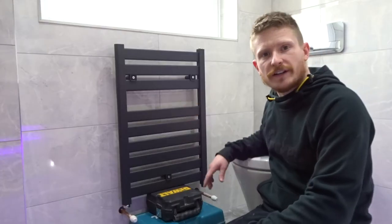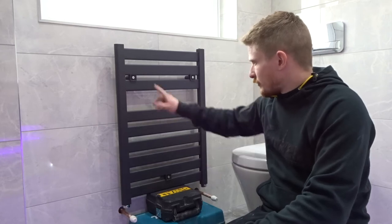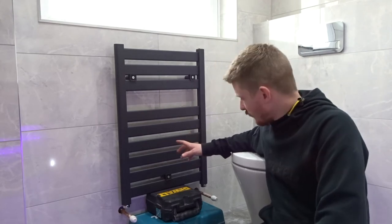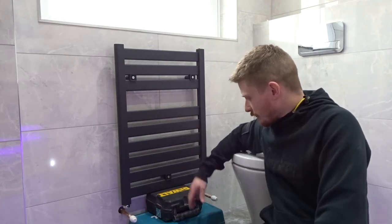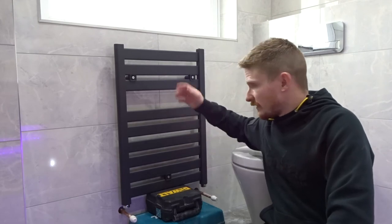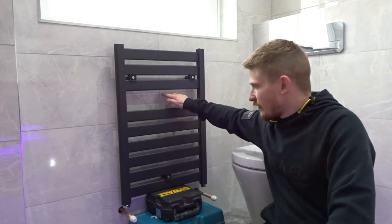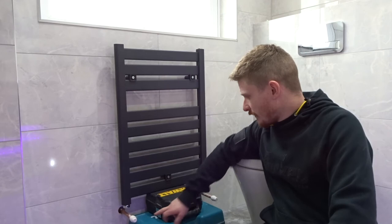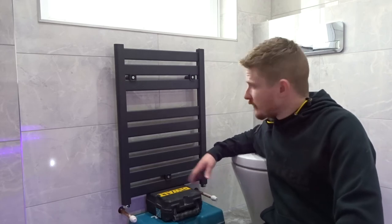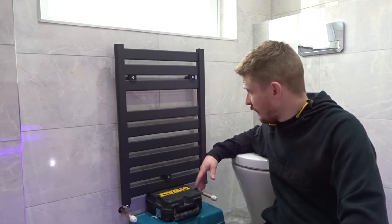So now we'll move on to marking out where we're going to put this towel radiator. I'm going to be drilling through tiles. I always find the trickiest bit is either having someone to hold it for you or a way of holding it in place — I'll just use a couple of tool cases to get it perfectly at the height that I want. I have a grout line running right down the centre of these two copper tails so I know where my centre line is. Otherwise you need to find your centre line to make sure the radiator is perfectly centred — you could use a laser level or a spirit level for that.